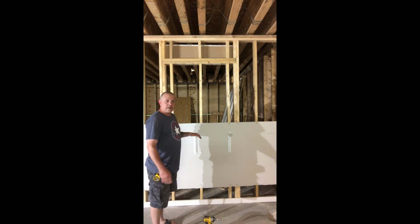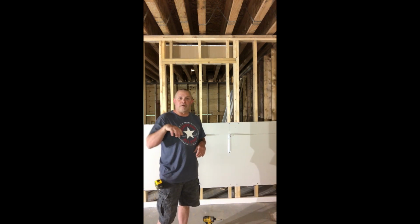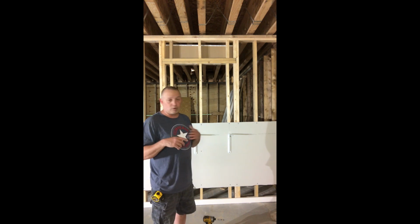This one's not, okay? I'm gonna grab the camera, show you a close-up of inside the wall, what it looks like, because normally you won't be able to see it. All right, so there's my feet. Again, I love to do that, show you my feet. Here's my anchor on the front side of the wall. Here's what it looks like inside the wall. This is what happens. Here's the magic right here. See that? I pushed the screw in, it spun that thing. It pushed that little bracket sideways.